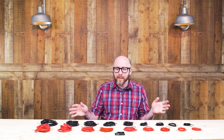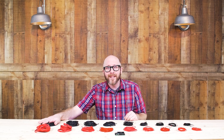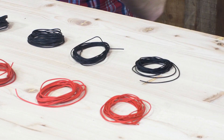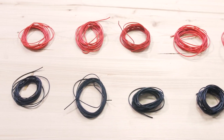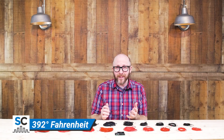As you can see here, that gives you 18 different options, all the way from this heavy duty 10 gauge beefy stuff down to 26 gauge light duty wire. This stuff is high quality in terms of its strand count as well as its outer jacket material being silicone. The silicone can handle up to 200 degrees Celsius.